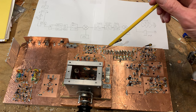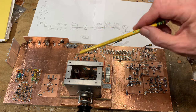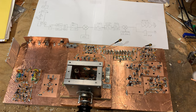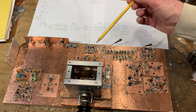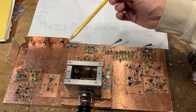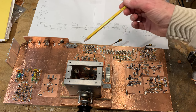I used a Colpitts circuit, and a lot of the circuitry is around the back — it's based on JFETs. I kept most of the active elements outside the box. Inside the box I have nothing but a couple of capacitors, the coil, and the main tuning capacitor, which should keep things cool. I've tested the VFO and it seems quite stable. I have a relay so that when I go from 15 to 10 meters and throw the panel switch, a second relay kicks in adding capacitance to the Colpitts circuit, bringing the frequency down to the range needed for 10 meter coverage.